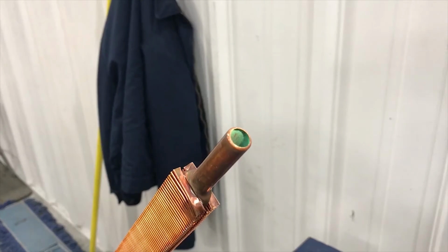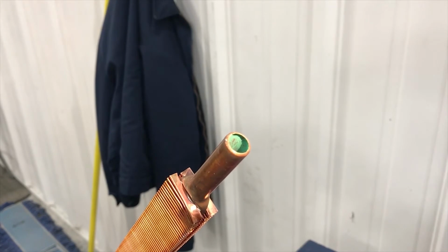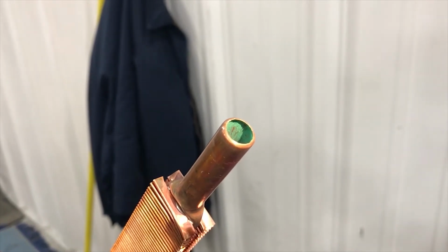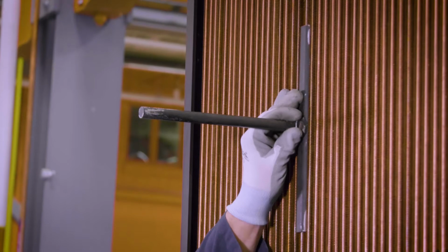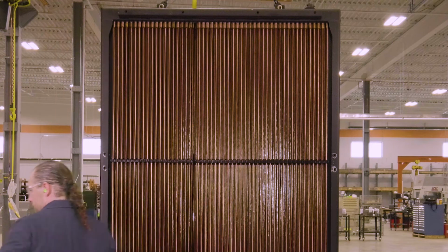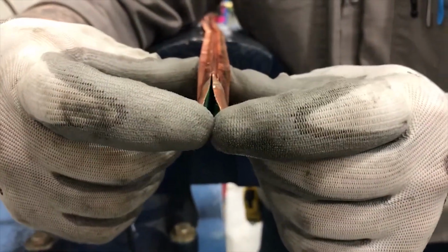If you intend to reuse existing tubes, now is the time to check their internal condition for contamination caused by dropout of cooling system corrosion inhibitors. If contamination is present, order new tubes. You can monitor internal contamination by removing 3 or 4 tubes from the air inlet side of the core, a few inches from both edges. Tubes can then be split for inspection.